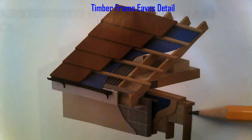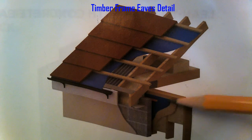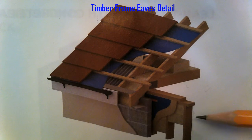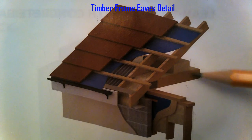The wall plate is 150mm sitting on top of the 150mm timber frame wall. We have insulation in between the studs, and we have 12mm sheathing — 12mm plywood — on the inside of the wall facing the cavity. On that there's a breathing membrane, and we have our cavity barrier here closing the cavity.